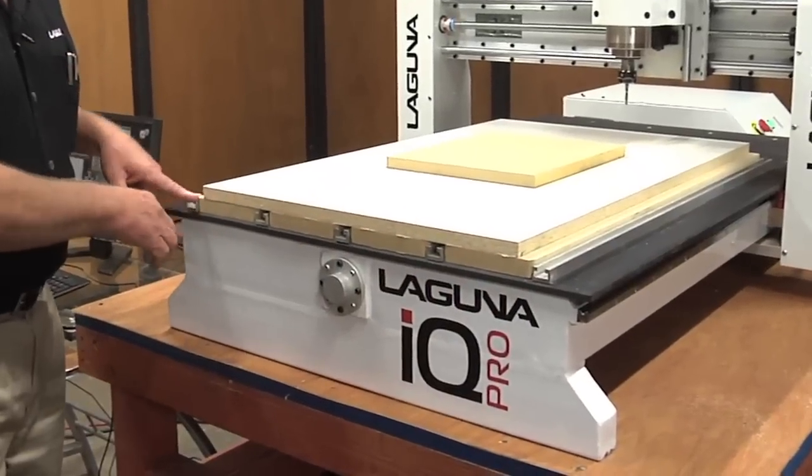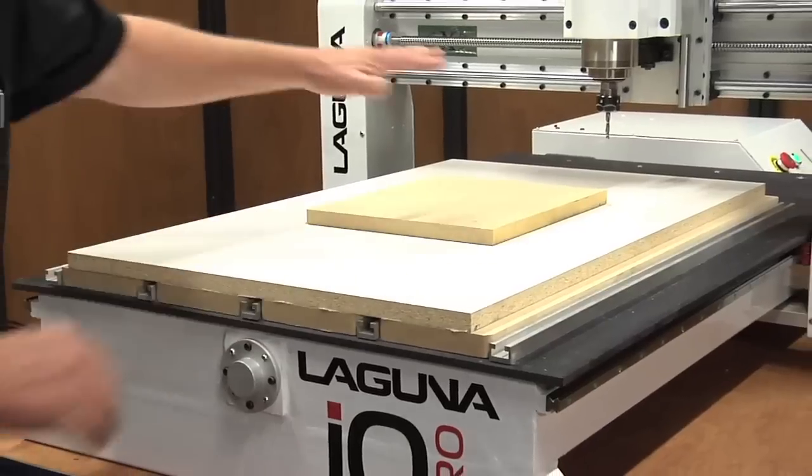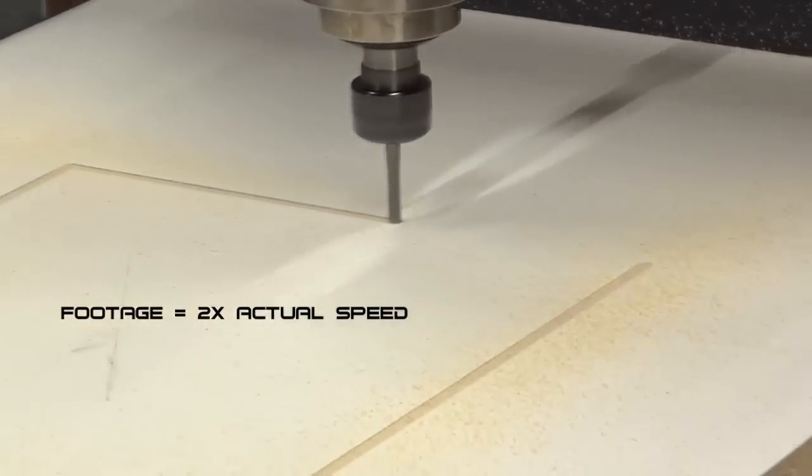One will be, of course, where we locate the blank on the machine's table, and I'll be using double stick tape, more than likely. The way I've got the machine set up is I fly cut those top MDF pads so they're perfectly flat, and then I've taped on a piece of 3/4-inch material. And then the blanks for the frame get taped on there. So the first program, I'm actually just going to cut a shallow groove around there to show me where to place the blank.